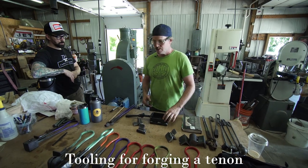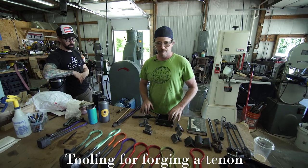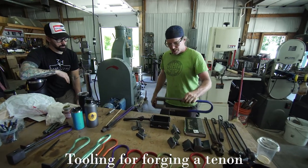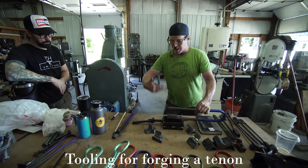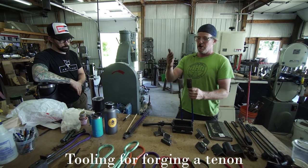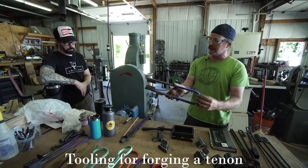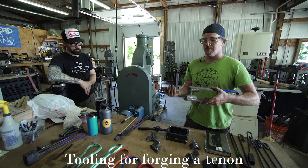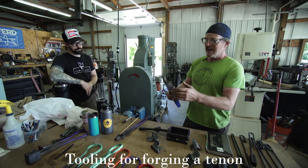The other thing that we're going to use is going to be a double butcher. Same idea. This is going to drop down on the die surface here. And then I'm going to clamp it in against the bottom die. And then just like previously when I showed butchering with a single butcher, this does the same thing, but it just is on a spring like this and lets me butcher from the top and the bottom at the same time, which is just twice as convenient. And I make these in different sizes.